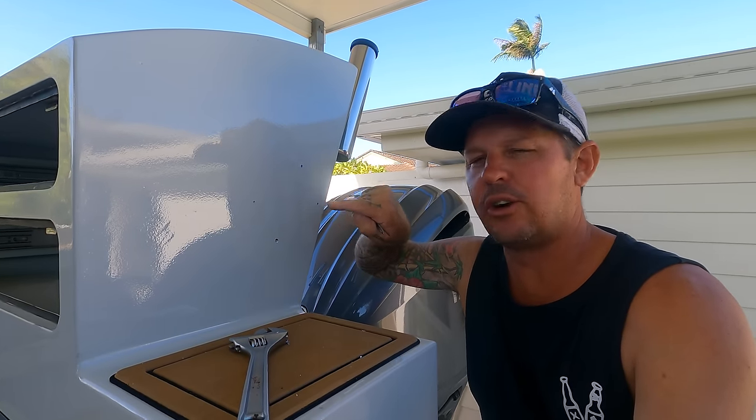because with two dissimilar metals, when you get stainless against alloy, it will end up reacting. This boat has taken every precaution with whip blasting and then primer, then a high build, then two coats of two pack. So there's a lot on it, but still it'll end up doing it. So I'm going to take every precaution. I'll heat shrink these screws that go in, and I'll also Tef-Gel it, and hopefully I shouldn't have a drama. With these top ones where I can just drill straight through, I've got nylon washers, so I'm keeping the stainless away. The only part that will touch the alloy is the thread, and I'll Tef-Gel the crap out of that. Hopefully, should be good. I'll tell you in 6 months to a year.